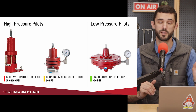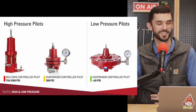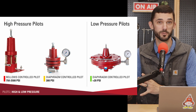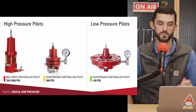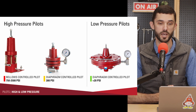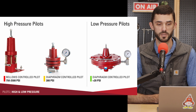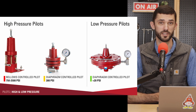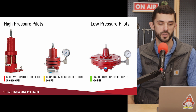You'll hear me say low pressure, high pressure, and then there's the Bellows controlled pilots, which are actually high pressure. I've mentioned before in these videos that 300 pounds is the line for Kimray products, mostly, and sometimes in our industry, that's the dividing line between high pressure and low pressure, either sub 300 pounds or above 300 pounds.